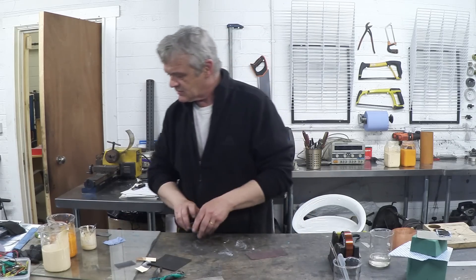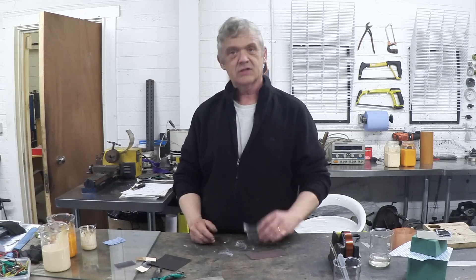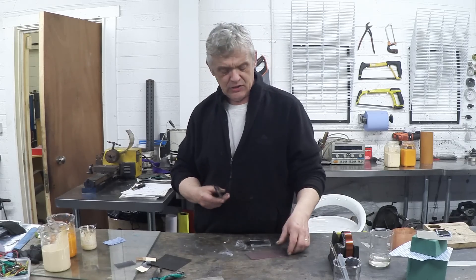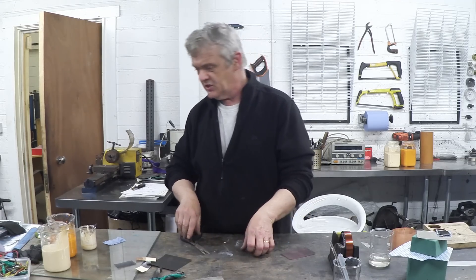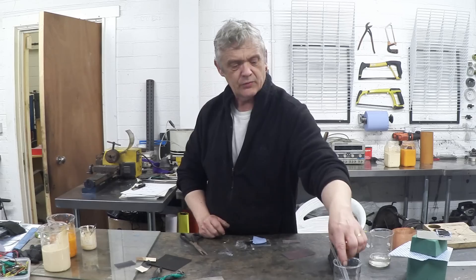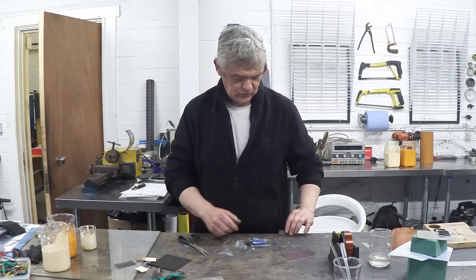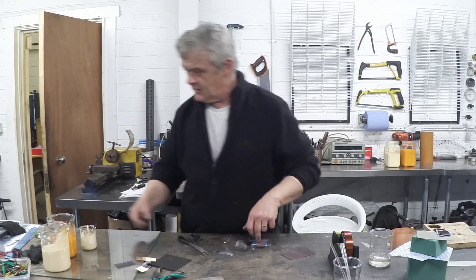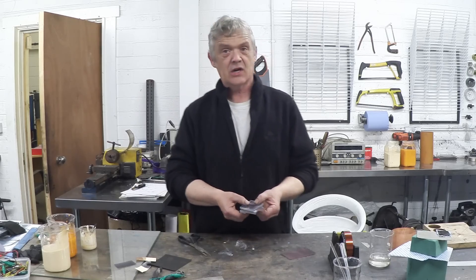These are quite simple to make. Once you've got your treated copper, you get a current collector for the other side — I'm using graphite foil here, to avoid any concern that there's a chemical reaction going on. We cut off a bit of the copper material, put a separator in, and the traditional electrolyte used on these solar cells is salt water — a little bit of table salt in some water. We put our treated copper on there and another bit of plastic on top, and that is our solar cell.